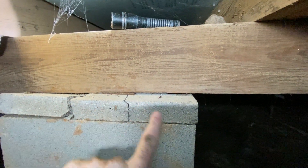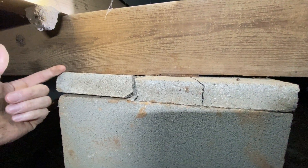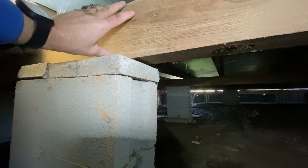The better solution is to actually not use steel shims — use cedar shingles run from the right and from the left side, which maximizes the distribution of weight across the entire sill much better than using steel shims.